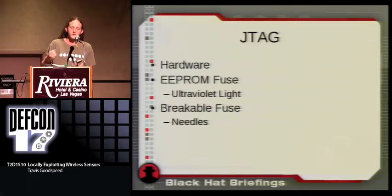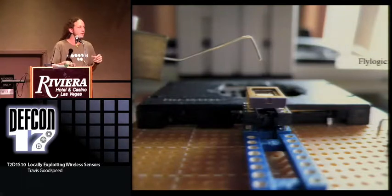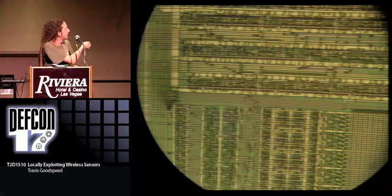If you hit an MSP430 with a camera flash, it continues to execute — sometimes things mess up accidentally but it doesn't trigger tamper-proofing. You can even use it to skip over the fuse check, jumping to the wrong JTAG state. I took this at DEF CON last year — Chris Tarnofsky had a demo setup where he stuck a needle into a chip to spy on the data bus and skip over a fuse. The equipment is expensive but not prohibitively so. On the left you can see the needle going into a line, and hardly any chip is properly defended against this.